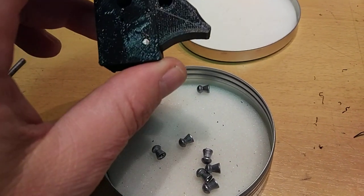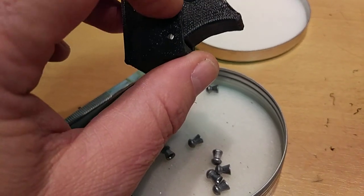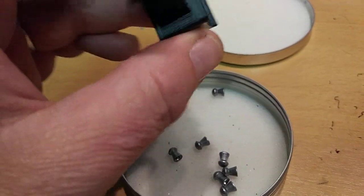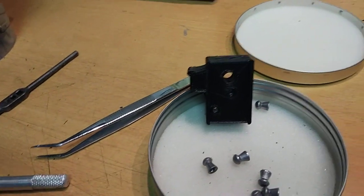The open position is held in place by a small ball screw with a ball and spring. The tension of this ball and spring you can set up here in the closed position with a small allen key.